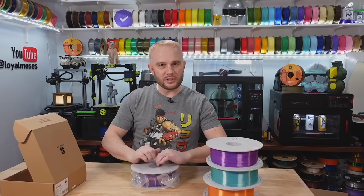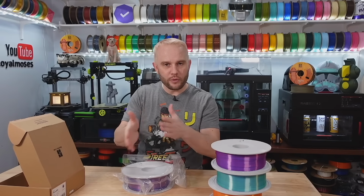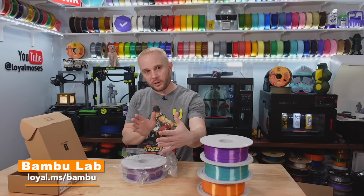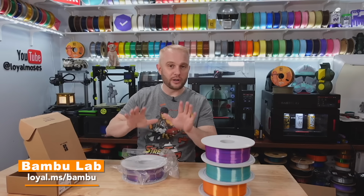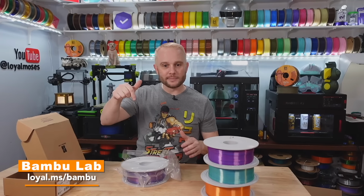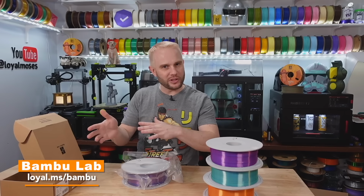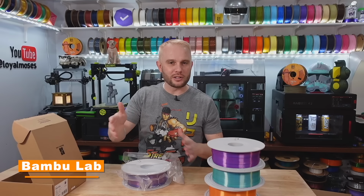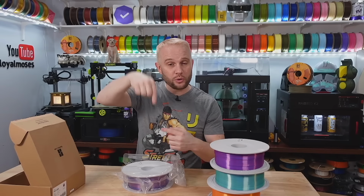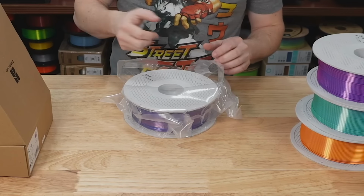And so what happens inside your 3D printer, imagine as it's extruding, think about it like toothpaste, two different colors coming out. Depending on the orientation of the model, as the print head is moving around, one side of the print will be one color, the other side will be another color. Now the crazy thing about dual color filaments is it doesn't stay that way. For unknown reasons, and many companies have tried to figure out exactly what's causing it, and some filament companies have done certain things to keep the filament oriented the same way through the extruder. It doesn't really work. The filament can twist, so as it's going through the extruder, sometimes it twists this way, that way, and you get these incredible fun stripes and randomness in every single print.